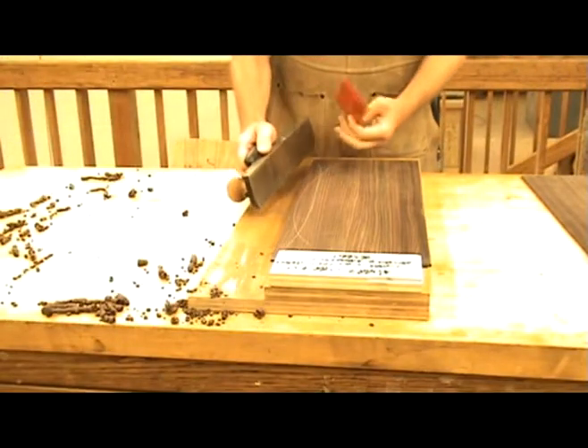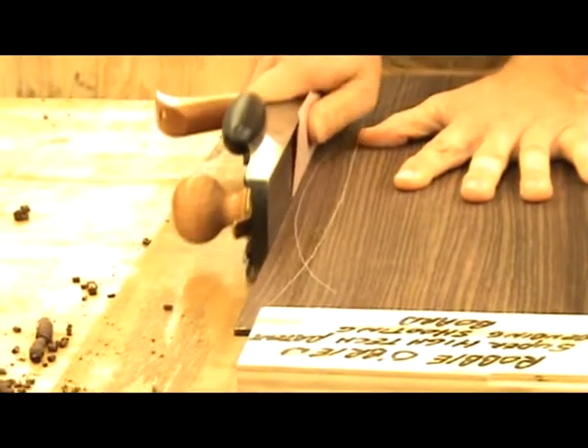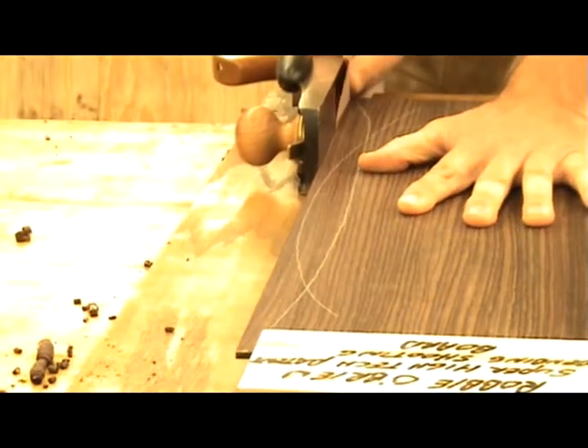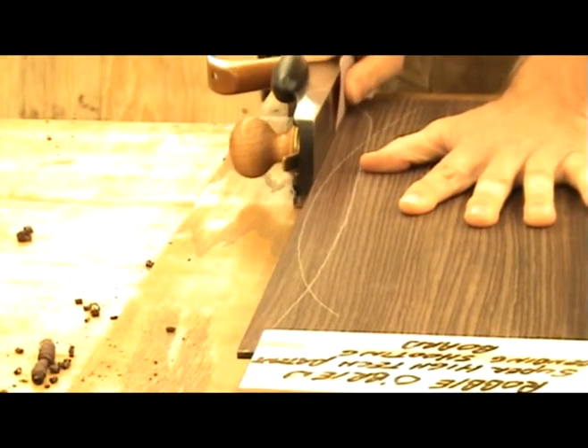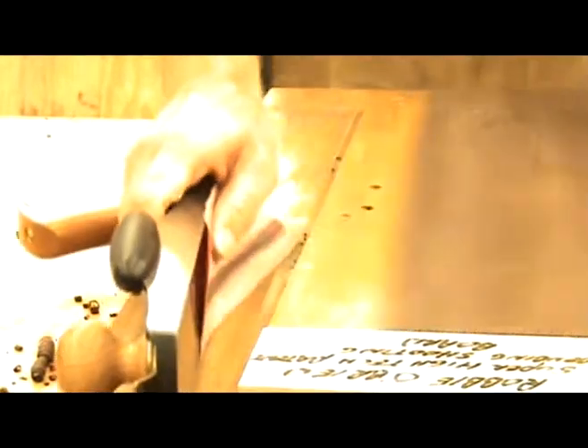Here's a little trick for that. Place a piece of sandpaper against the sole of your plane and lightly sand the edges to be joined. This will get you that perfect fit with no gaps. On a good day, a few passes with my plane and then perhaps a bit of sanding using the plane as a flat edge and my top or back joint is perfect and ready to be glued together.